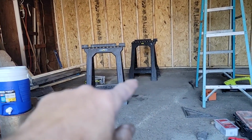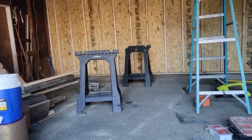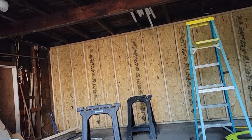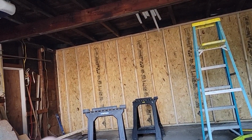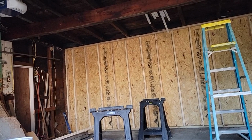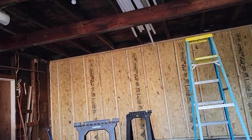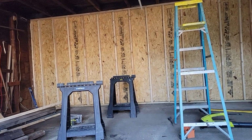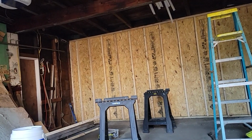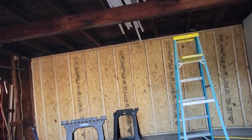But we formed our concrete level, and I measured left and right, and it's exactly the same. It was like, what, 94? And so when we jacked it up, this whole plane is 94 now. And our sheathing goes down past 2 inches. So everything lines up really nice. Tightens this garage up. Should last another 100 years. And if he wants to insulate it, they're going to fit in all nice. And then the last one, he can rip one in half, fit in there.